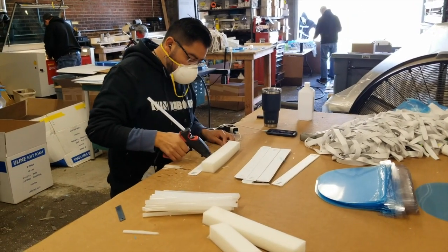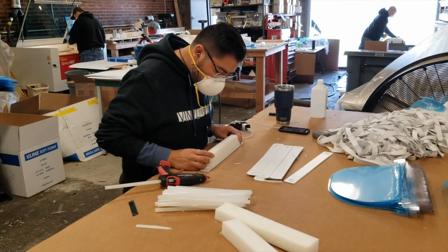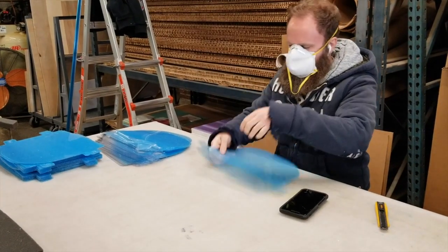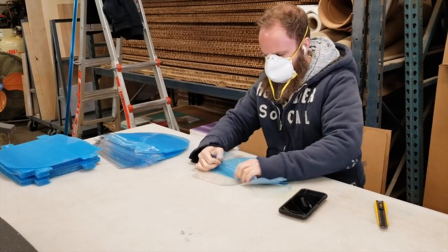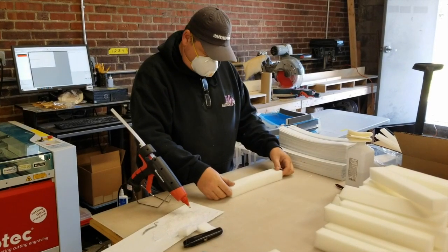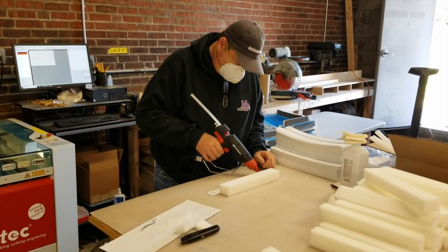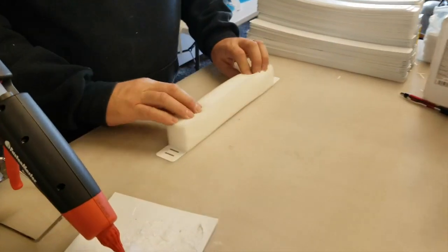Here's Gustavo — we're using hot glue, you could use low temp or high temp. The high temp seems to bite better, but you have to be a little bit careful because the polystyrene at 020 is heat sensitive. Here's Andreas, he's our senior designer and project manager — right now he's stripping back the pre-mask front and back to get ready for the final assembly when we put the headpiece on and the elastic gets cinched through the edges of the face shield. Here's Frank, he's hot gluing as well. He'll put a little strip on there back and forth, and he's got the foam block lined up to the polystyrene so he knows where to start and where to stop, so we don't have hot glue seeping out the edge. You'll notice there is white foam and black foam — they're both the same thing, it's just a matter of what's available and what I can get my hands on.